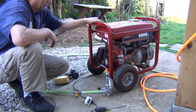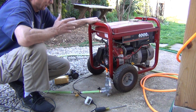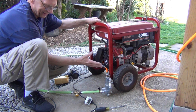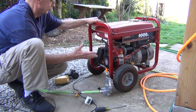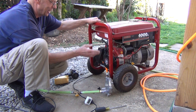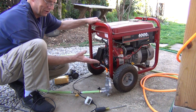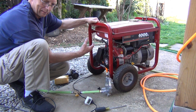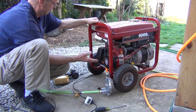With this kind of application, you're going to lose more horsepower on the engine because you're actually blocking the air inlet and replacing it with gas, which is not exactly what this is built for. The best thing would be to re-drill the carburetor and bring the gas straight into the carburetor — that's even better than the donut conversion kit. But it works.